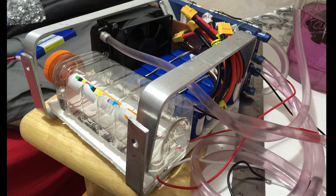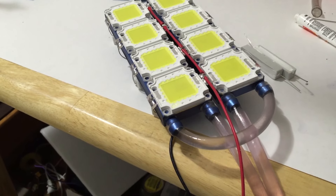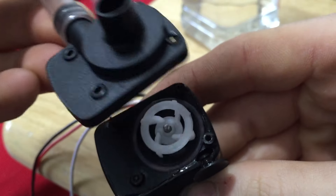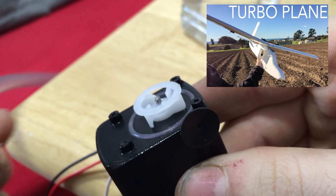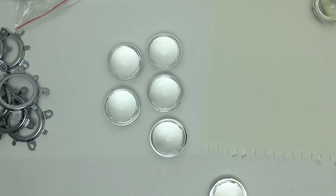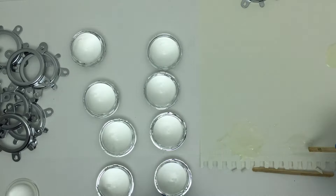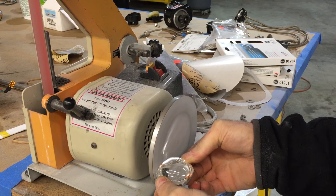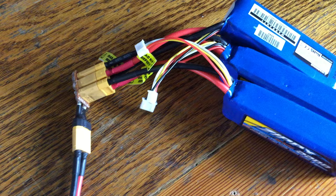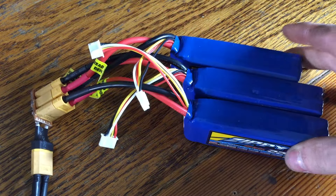And now it's time to figure out the plumbing! This is the little water cooling pump — you might recognize the centrifugal impeller concept from my other video. I did some surgery on a plastic bottle and sealed the pump inside it. In order to get the lenses mounted so close together, I used epoxy to bond the lenses onto the reflective housings, then used a disc sander to grind away at the edges and more epoxy to glue the lenses onto the LEDs. The light is powered off of three 3-cell lithium polymer battery packs connected in series to produce about 36 volts.